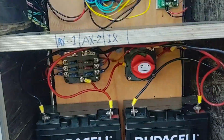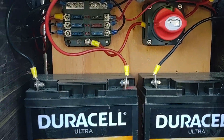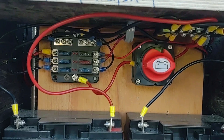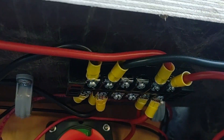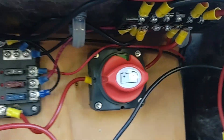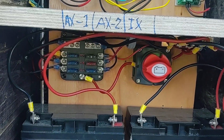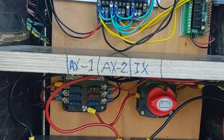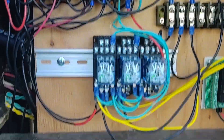At the bottom I've got some 12 volt batteries right there. I've also got a fuse panel, a cutoff switch, and of course the distribution bus for the batteries running off of 10 gauge wire. I really needed some heavy-duty stuff so I wouldn't get a bad voltage drop.